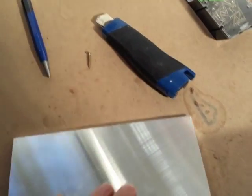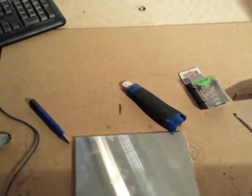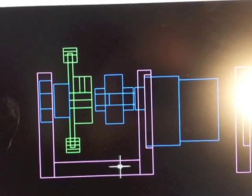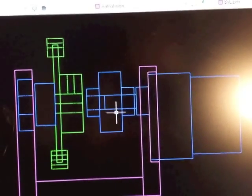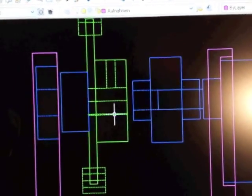The first step is I purchased some nice aluminum — the thickness is eight millimeters. To fix these, I just marked the corners here to drill the holes; this is for fixing the aluminum plate on my work table. The design you can see here: in pink color are two wall sides and one bottom plate. They will be screwed together down here. Here you can see the DC motor, and here is a coupler which expands the diameter from six millimeters up to eight millimeters, which is the inner diameter of the tooth wheel.